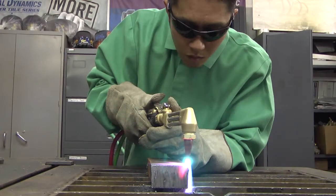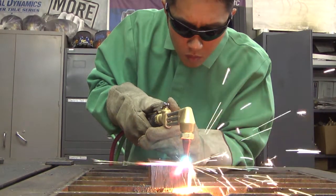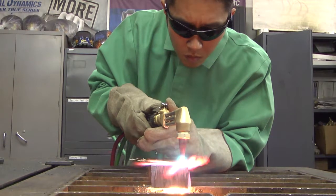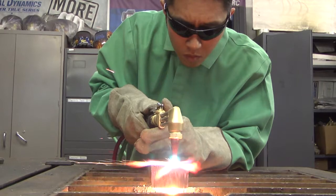The best method of doing this is to put the tubes in line so you have better visibility, so when the user is actually cutting he can see his flame without having to look from one side to the other.